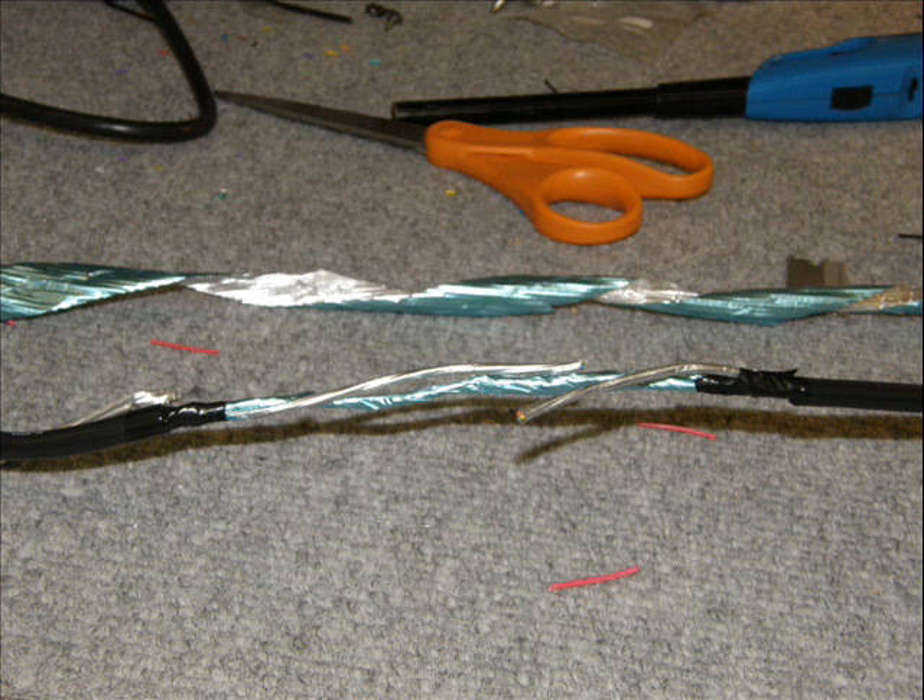Here's where we need to look at that mylar drain. Its job is to get any extraneous signals out of the wire, whether originating in the wire or from the outside. It's a very thin plastic which is aluminized on one side, making a conductive coating. This coating doesn't conduct very well — it's just to collect the electrons and get them onto that bare drain wire included in each set of wires. So what you want to do is return the original drain back, wrap it around the wire tightly as best you can. If it's damaged or missing, get another piece off of another wire. In this video I used some from an old printer cable to add a little extra insulation and repair any damages. Wrap that from end to end, put a little tape on it to hold it in place, and get it nice and tight.